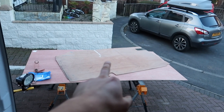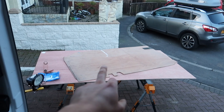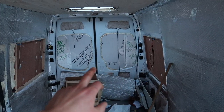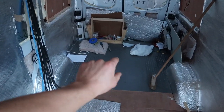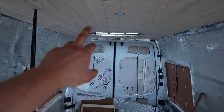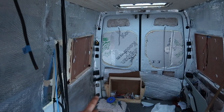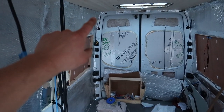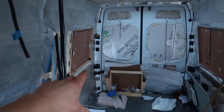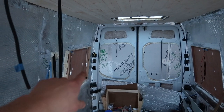As you can see here I've got the 9mm hard face marine ply which I've used throughout the build, and the 6mm original template taken from the van in the first place. Basically what you want to do is measure the depth of your floor and ceiling, rip that measurement off the original template, then measure between where your ceiling and floor are sitting — that gives you the width to rip your new board to.